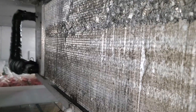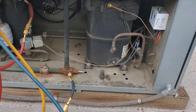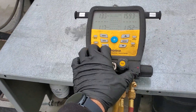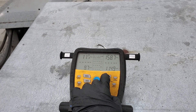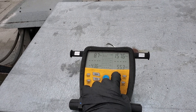I'm going to give it a rinse from the backside — it's all defrosted. It doesn't even look like it's going to need cleaner like the other one did. Then we'll start it up and hopefully everything else works. It is starting to rain on me right now — it's dripping all over me, so we're not going to spend a bunch of time on this. I'm going to make sure the sight glass is clear. Oh boy, we're running low suction pressure right now. This thing has a Johnson Controls A19 temp control — I wonder if it's calling.